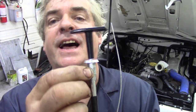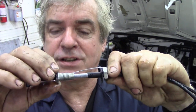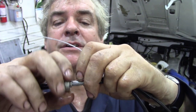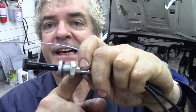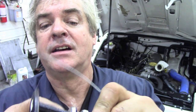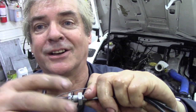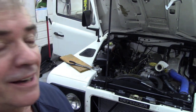It's supposed to have a little flat on here, which it has, but they're really pathetic and these tend to spin. Top tip: when fastening these down, once you've got your nut wound on a little bit - not cross-threaded - put a pair of vice grips or pliers at the back and hold it while you tighten the nut up. Don't hold it by the handle - it can twist inside this aluminium fitting, lock it up and then it's buggered. We've come a long way, we don't want to fall at the last fence.